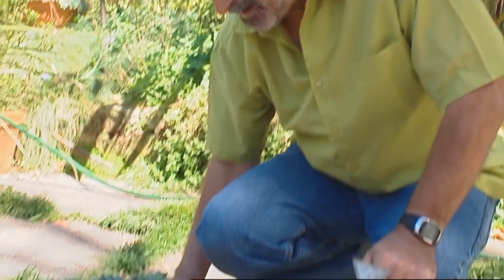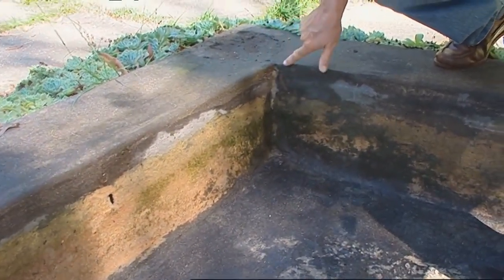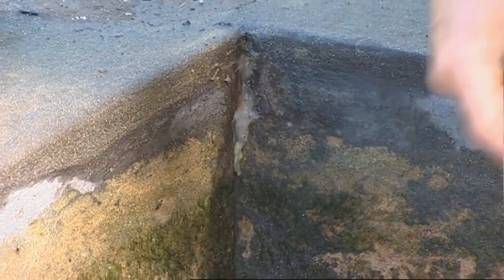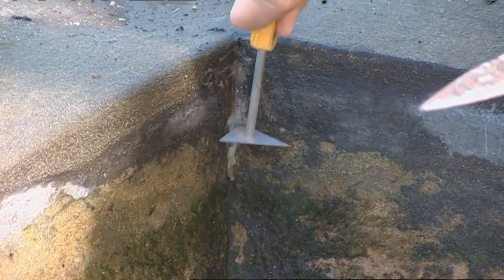Before we gurney the pond out, we've got to look for all the bits we can find. Now if you look here, you can see there's been an attempt to fix a guess at where the holes might be with some silicone. You can't leave that there — that has to be removed. So we'll try and scrape that out.